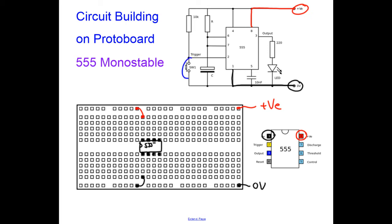Start with the switch — once again the switch is going down to ground. Put the switch at the bottom of the board with its flat edge parallel to the long edge. There's a wire going down to 0V, then a wire connecting to the resistor. I need the resistor on the board, leaving plenty of space for other connections. The blue wire connects the resistor and switch all the way across to pin 2.